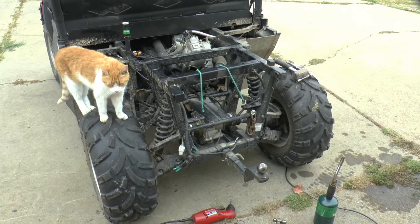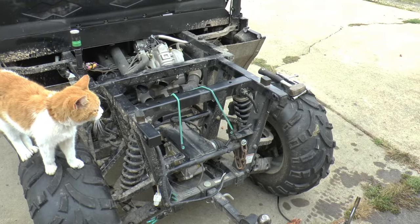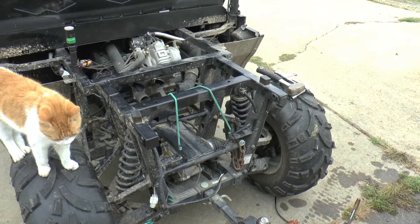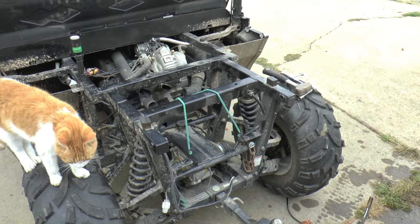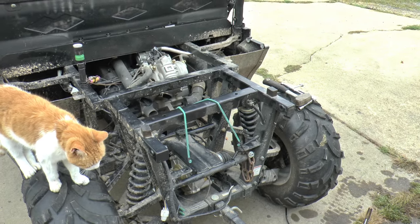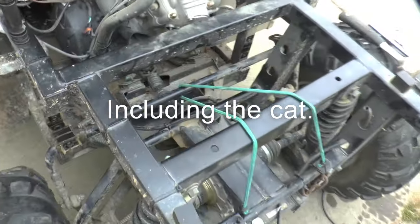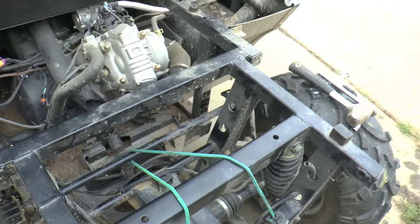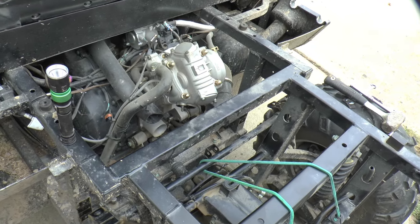The project is coming — it hasn't gone south yet, but it hasn't gone right either. It didn't drill directly in the center, and I've tried the easy-outs and the piece in there is not coming out. So I've decided to drill it to tap size and tap it out and hope for the best. Of course everything is in the way — this bar here I had to unbolt and pull up out of the way. I'm going to tap it and see how things go.